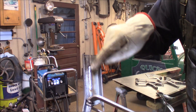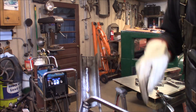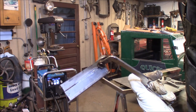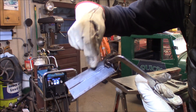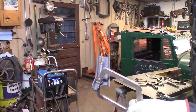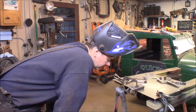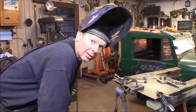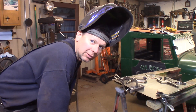I went a little fast on that first pass because I've got a lot of bead buildup here — it was starting to look alright but I went too fast. On the back side though it's got good penetration through. Let me slow down a little bit and practice for a while to see how I can get nice welds going.